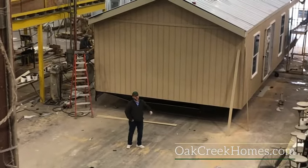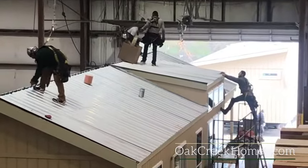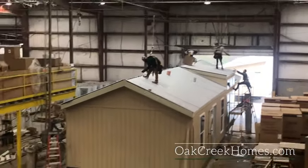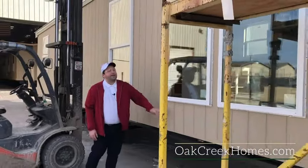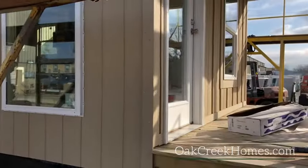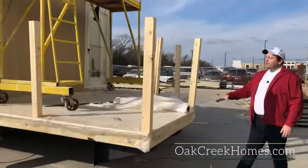After our roof decking is applied, we put our standard metal roof on. If you prefer to go an architectural shingle route, we can do that, but every Smart Cottage comes with a standard metal roof available in red, green, or silver. Every Smart Cottage comes standard with smart panel board and bat exterior, and Simplank lap siding in the tower dormer. Smart panel is mixed with zinc borate and other resins that help minimize wicking, water absorption, and make it termite resistant.